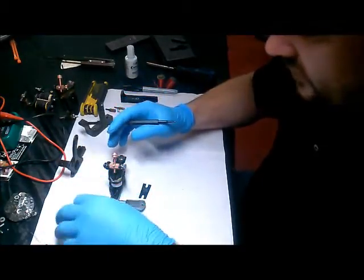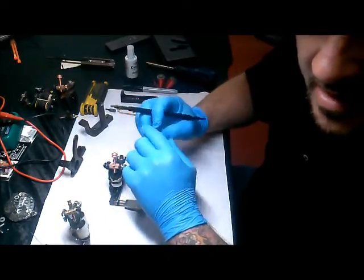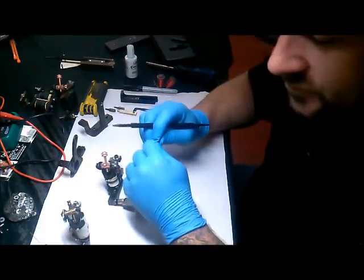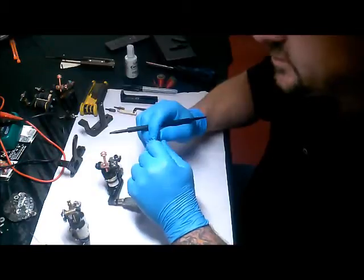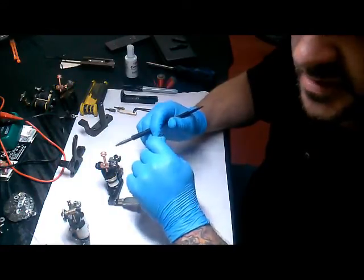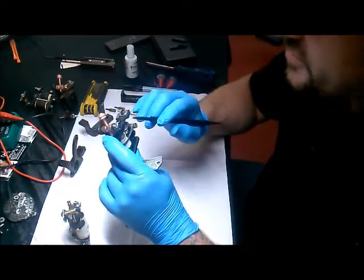But fiddle around with that for a little bit and you'll find that as long as your spring tension is correct, spring gauge and setup for liners or shaders, you can play with that and find different effects, what your personal preference is. But typically, 18-16 liner, 20-18 liner, 18-16 shader, 16-16 shader if you want. But anyway, spring setups are really important. You don't just throw a new spring on back there.